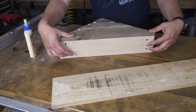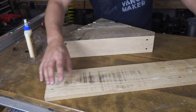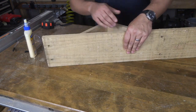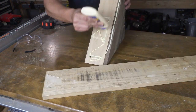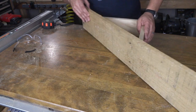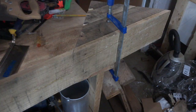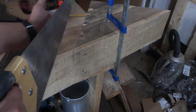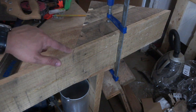Now that this part is done, you want to face the front of it. You may need to use a couple of boards to cover up the front — I happen to have one board that's wide enough. So I'm going to flip it over. Put this board right here; it's going to be square across the bottom and it will cover the face. If you don't have a flush cut saw, you could easily use a regular hand saw — just make sure that the face of the blade rides up against this, and that way this cut is going to come out at the right angle.